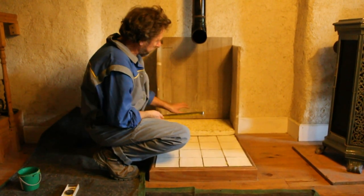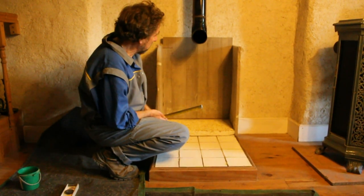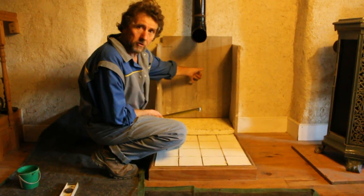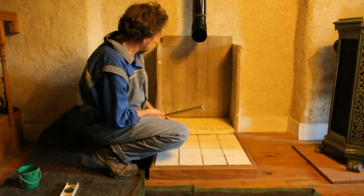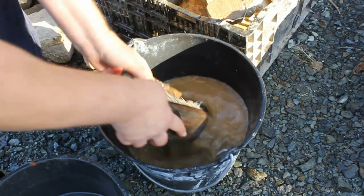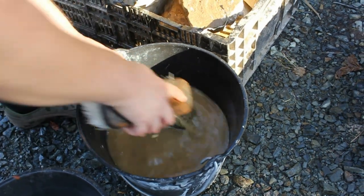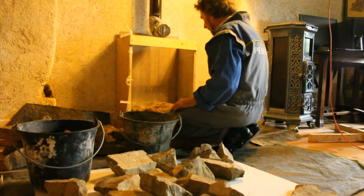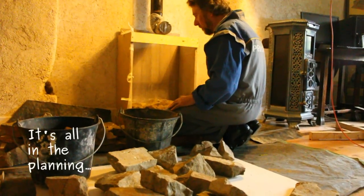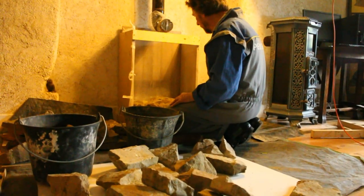The stove's out. This is where we're going to put the stones, and these will guide so that the wall stays nice and vertical, and none of the mortar is going to drop out — it's all going to be trapped neatly at the rear. I'm just trying to get the first layer of stones laid in there before I put the mortar on, so I can see how it's going to shape up. It's a little bit like a jigsaw puzzle without the picture.